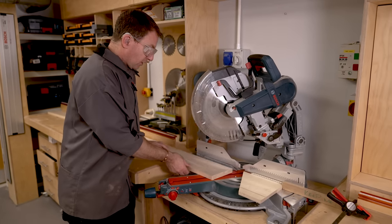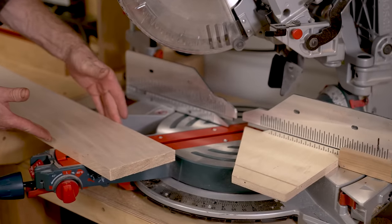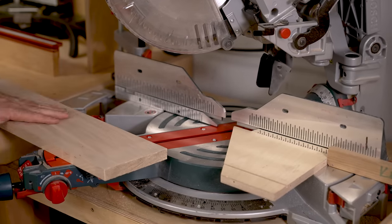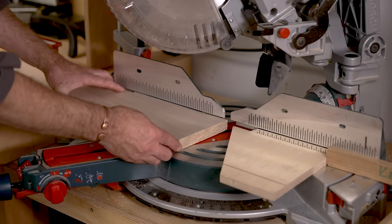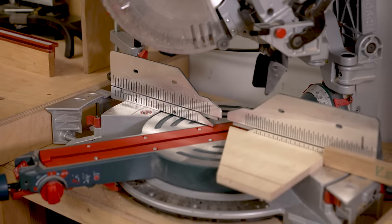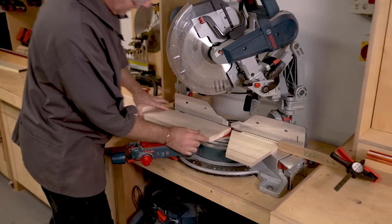All right. So obviously our board can go in. We've got a length of sycamore. This is 140 millimetres wide, 20 mil thick. All right. Leave it just as a long length. You obviously need six of these, so it's worth having something a bit longer. Done this so we can cut off. Now just checking the end of the board here is quite clean. The other end, yeah, okay, let's go with that because that's been cut previously. No splits in this end.